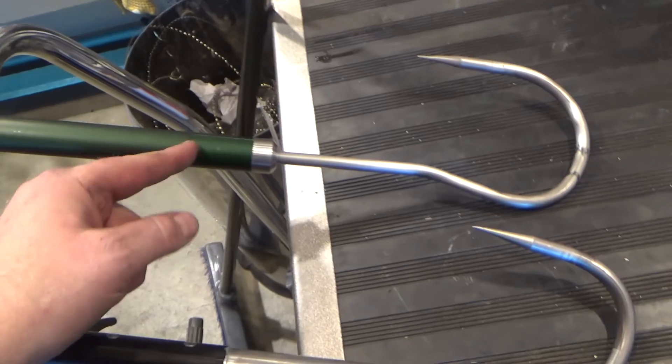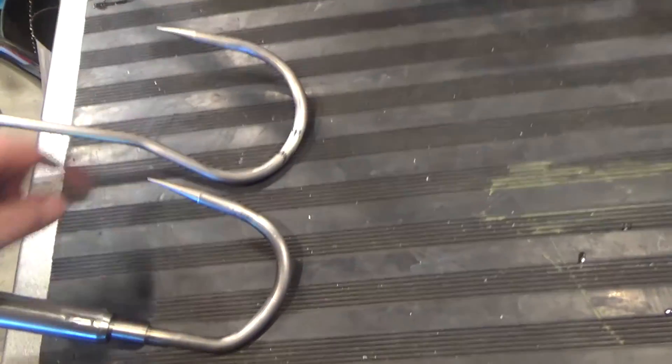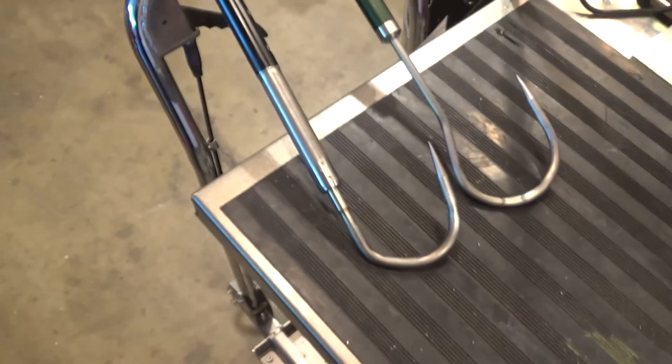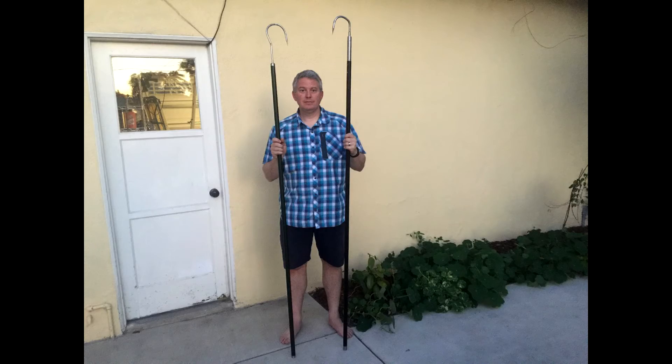Here's the finished product. The original version has the heavy large metal piece going deep into the shaft; the new version uses a much smaller, lighter piece that doesn't go in as deep, with a smaller-diameter rod, a double bend instead of a single bend, and a smaller end piece. The new one fits nicely in the aluminum tube. The homemade gaff is complete — 316 stainless, should be salt water friendly. Thanks for watching, hope to see you next time.